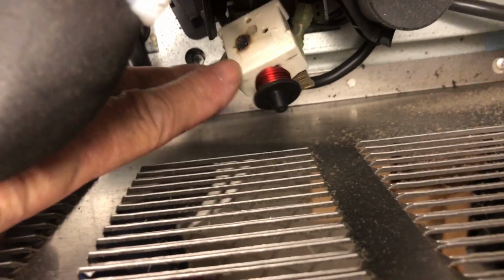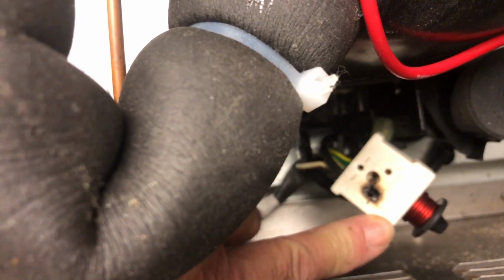You can see the overload's burned up here. The relay, the current relay. So we got plugged condenser, big old sprung leak, disc blown up. The terminals on the compressor aren't looking the greatest from where that burned up. I can focus in on those a little bit. I'm not even gonna mess around. I'm gonna quote a new compressor. We'll rebuild the condensate loop. We'll replace the thermostat and the 2 probes on this one. I think that's a start.